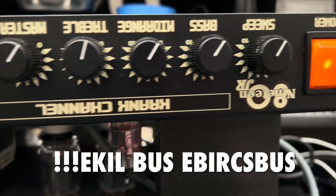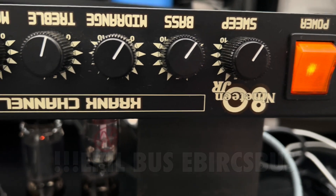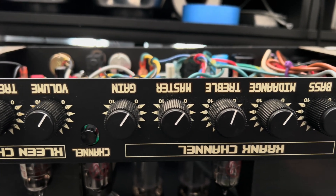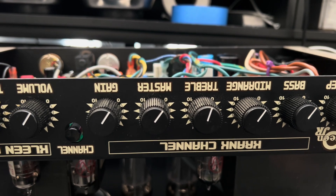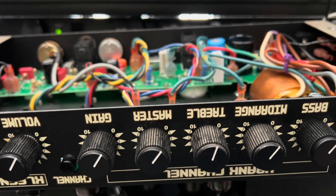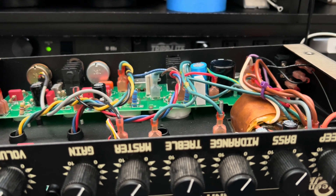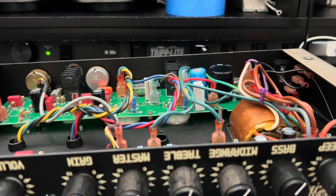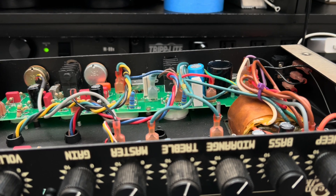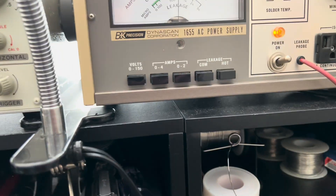Good morning — we've got ourselves an Old Crank 1980 Junior, and as you may have surmised, it's their take on a JCM 800 circuit. I've already put in a lot of work here: it was not switching channels, had excessive background hum and buzz, along with a plethora of other small and annoying issues that when combined created a very poor user experience.